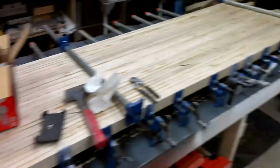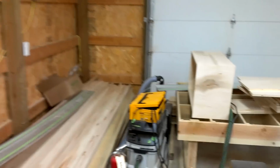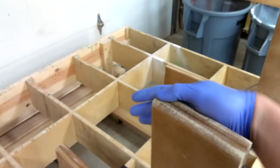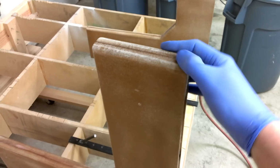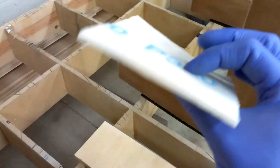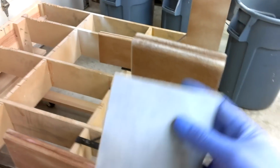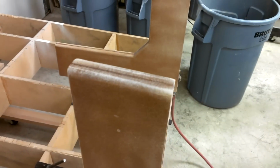And also the sand time on it. Now there's air blowing on them from my air conditioner here, but 10-minute sand time on this, so that's really nice. Sanding in between coats. The reason this kind of looks a little weird here is I just hit it with some Festool Granat, 320, foam back Granat, which is really nice for stuff like this. The foam back kind of keeps you from gouging it, and it's just awesome.